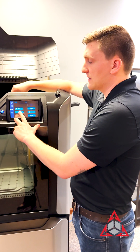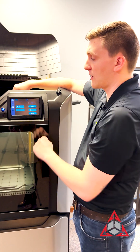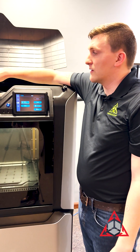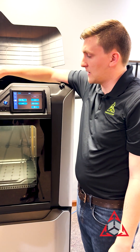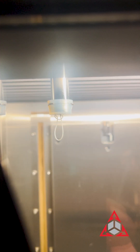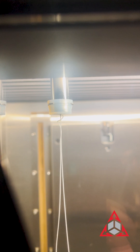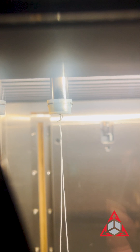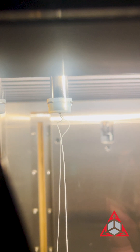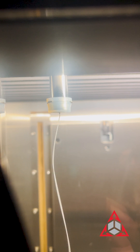You'll notice that the heat is going to climb from 90 degrees — which is the internal temperature — to the target temp of 265 Celsius. Then you will see the material start to pull down and purge. That is a good, even, slow, steady purge. A lot of the times with stuck material like this, you can get that good even purge without the material releasing, because the gears might be working in one direction but not in the other.